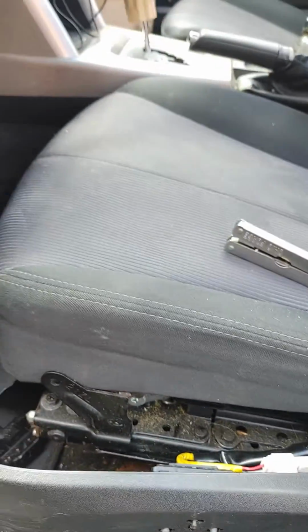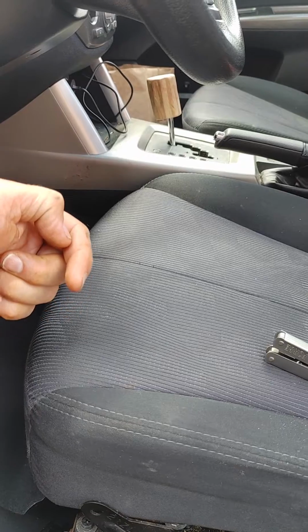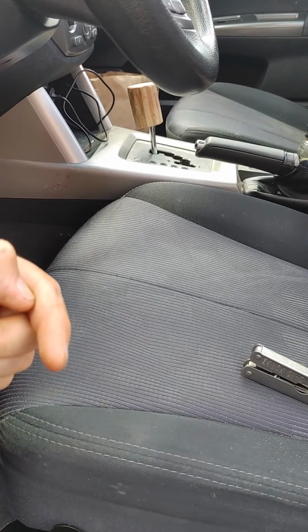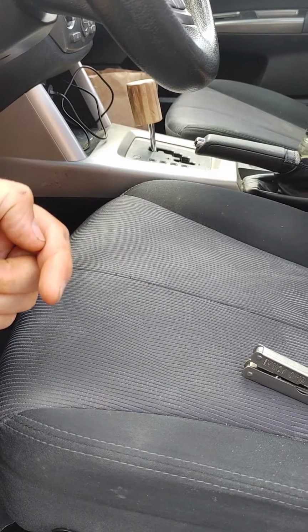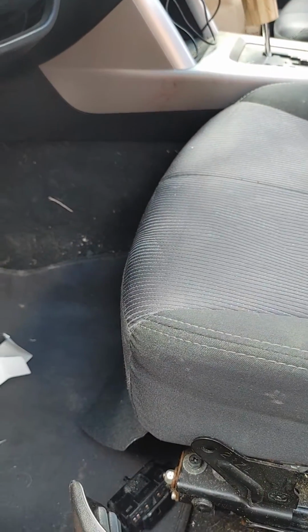So I don't know if I'm going to be able to totally show you here, but the motor cable was right under the very front, and I'm probably not going to be able to see it all that well. I'm kind of an amateur at this, but anyway, I was fishing around way under the seat, and it turns out that motor cable plugs in sort of in this direction. So the male motor cable plugs in towards the outboard, and it was just something that had come loose.